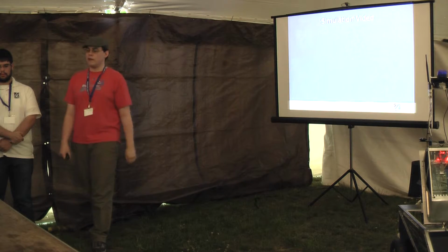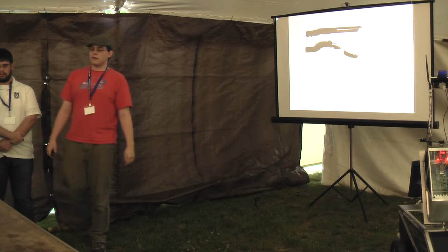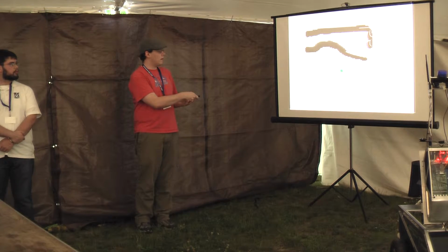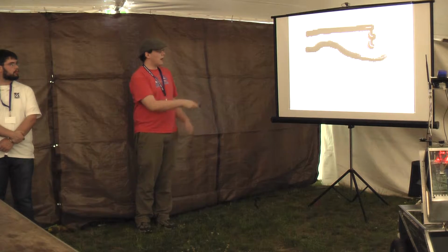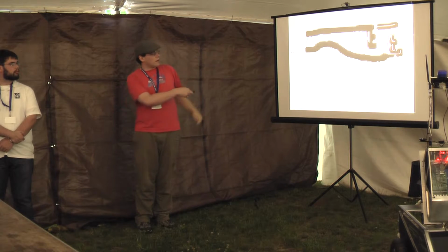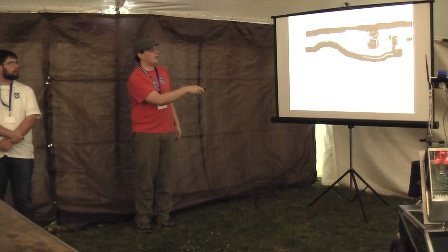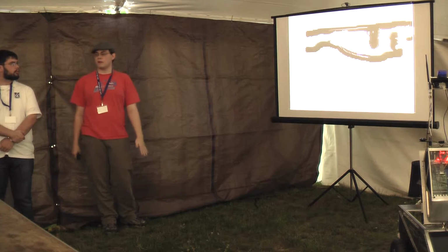And we're actually going to show a video of the simulation environment. This is the visualization of the environment. So essentially I just placed a waypoint right here. You can see this green line is the path that's being produced. And the black is something that's considered an obstacle on the merge map. The lighter color here is something that's considered clear. And the two lines coming out of the robot are involved with FLOW, which is the obstacle avoidance. They're basically describing the lane that the robot is taking.